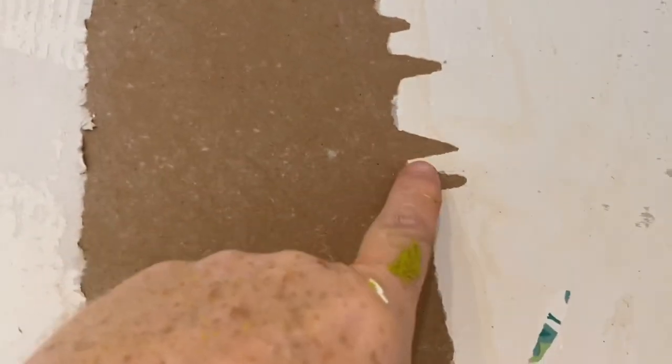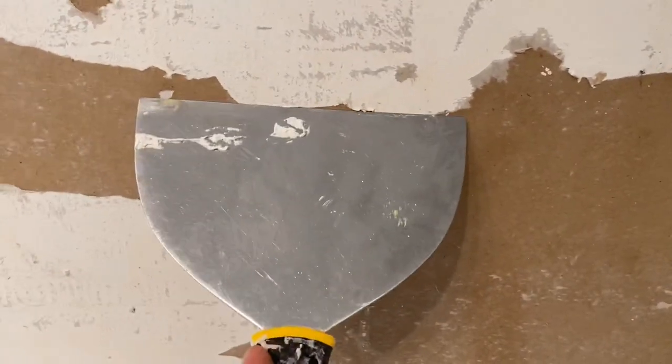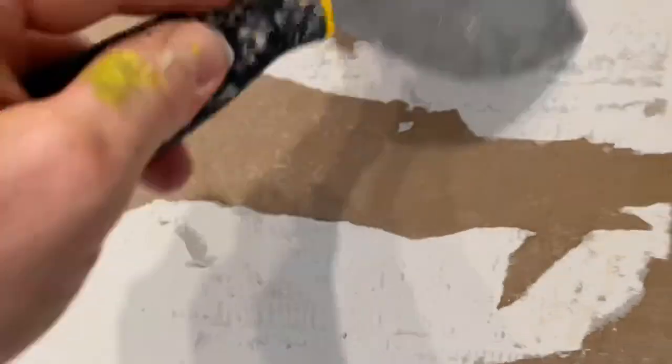You want to challenge the entire edge — go head on with it. You see what just happened? That's what would happen if you pole sanded; it would drag the paper and just tear it. But when you scrape at it, what you're doing is arresting the peel. It's not going anywhere else — that's strong, that has integrity. Now you just cross. She's ready to get tied down with our primer that I'll introduce when we get to it.